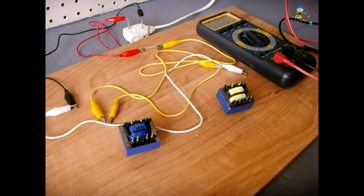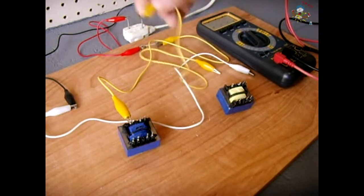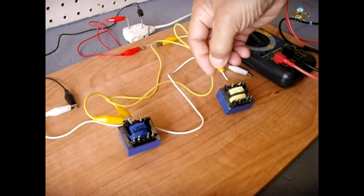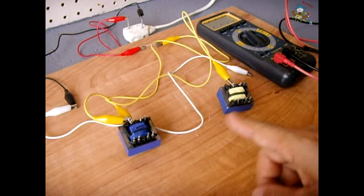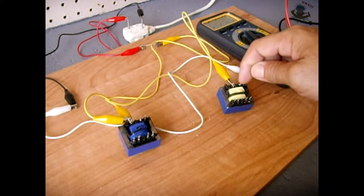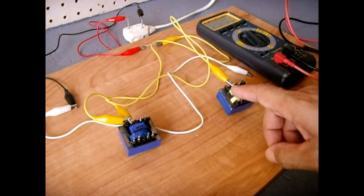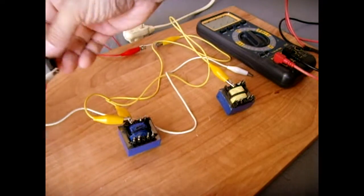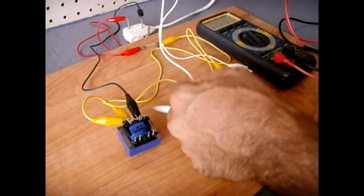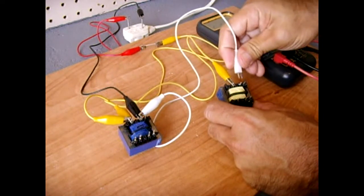To connect these in parallel, it's very simple. Take the hotline in with the fuse, connect that to this side here. You're going to jump from right here, put this on this side so it's out of the way, and make sure it goes in the exact same spot. If these are identical, the winding goes in the same direction for both. As long as they're identical — exact same transformers — you're going to put the jumper to the exact same terminal on the opposite transformer. Now take the neutral and connect that there, and jump this side over to the same pin on that side.